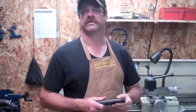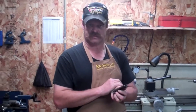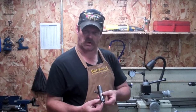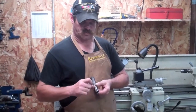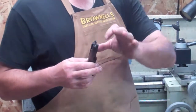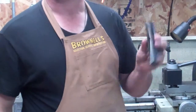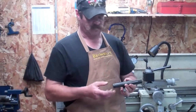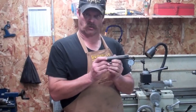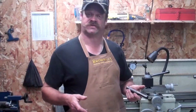The Finns ended up reverse engineering these guns and made them in 9mm. Now, you have a full-auto bolt, but this is what you cannot use in your semi-auto legal builds. What we're going to do is: first, remove the extractor. Once you remove the extractor, you've got a fixed firing pin that can be easily removed. Next, you're going to center drill the entire bolt through its full length, make a separate firing pin and firing pin retainer, and convert this from firing open bolt in full-auto to closed bolt with a hammer striker against the firing pin.